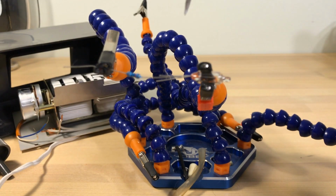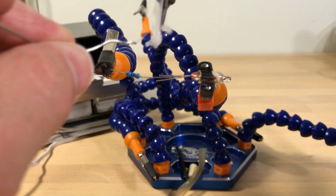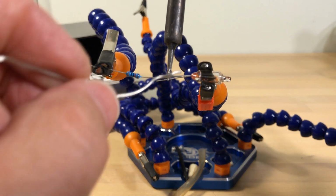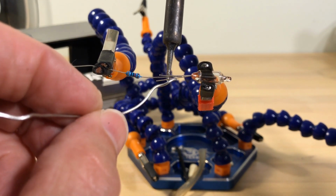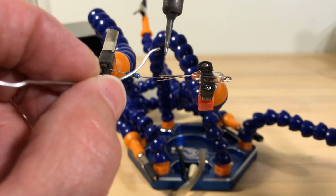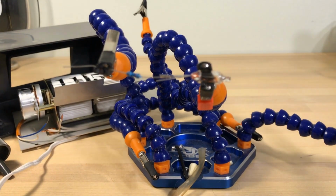It's gonna work. So what you do is you actually heat the wires up first. The mistake people make is they try to melt the solder and drip it on there. You don't do that. This is rosin core solder. The rosin just helps things stick. Just a little, that's what that smoke's from. So you actually heat the wires up first. Some people say heat the wires up and let the solder melt onto those heated wires. I think that's too hot. I cheat and I'll touch the soldering iron to kind of get it started, and then it flows like that. So that's how you know you got a good connection.